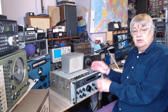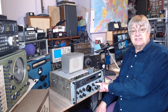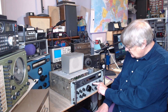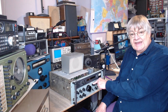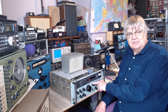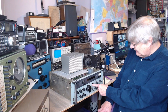I'll do a USB Volmet recording in a minute. The only thing that people might say — oh, that's no good — it's USB only. There's no lower sideband position on the mode switch. You've got AM, USB with the BFO, USB on its own so you just use the tuning, then you've got ISB. Now, ISB is independent sideband — I have read about it, I've got to learn a bit more. You've got ISBU and ISBL, by the look of it.